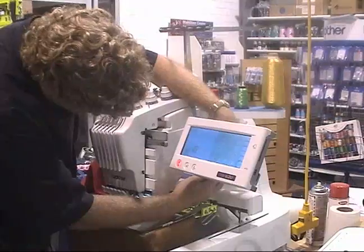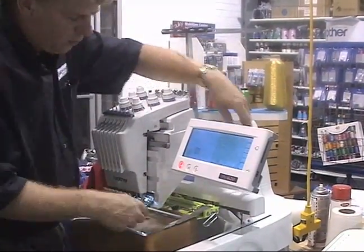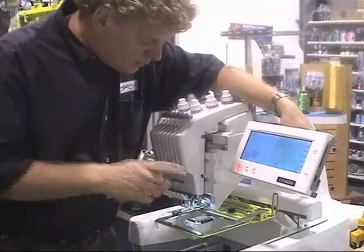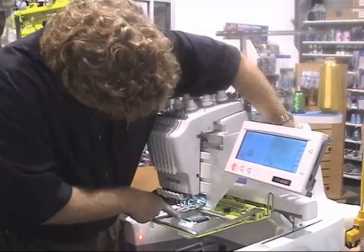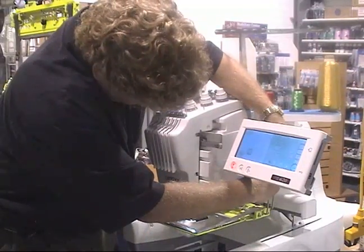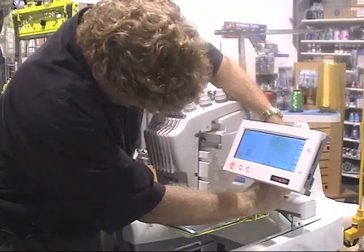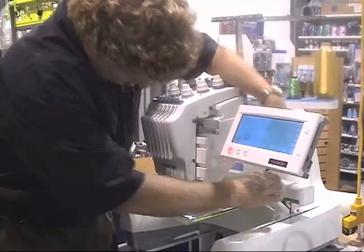I place it at an angle, and I pivot the head around to where my laser beam is shining down to my needle hole. I don't need any work loaded in the machine right now while I'm trying to align this laser. It's a little tricky — it'll take you a minute or two to get the beam focused on the needle hole, by pivoting and moving in and out until you get it in the right location. Just a little bit of tweaking, then lock it down on the needle hole, just like that.